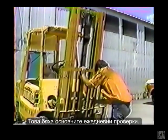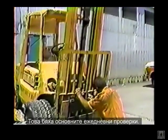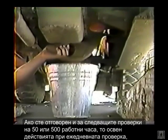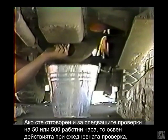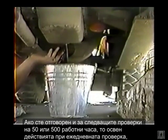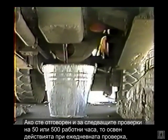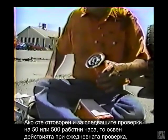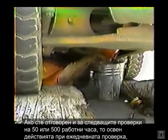That's it for daily checks and PMA. Remember, you are supposed to do a PMA every eight hours, but you're also responsible for PMB too — after every 150 hours of operation. The only differences between PMA and PMB are the additional steps of changing the engine oil and replacing the oil filter. One important point about changing the filter: always coat the gasket of the new filter with grease before you install it. The grease creates a better seal and makes the filter easier to remove the next time it's changed.